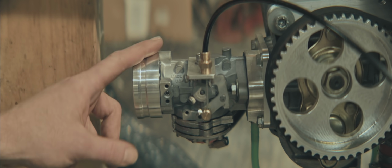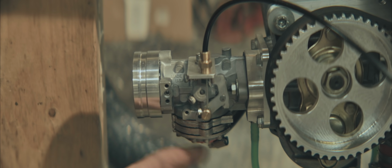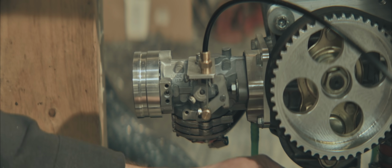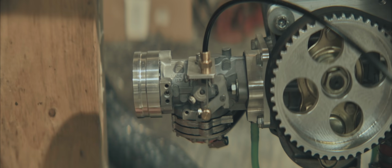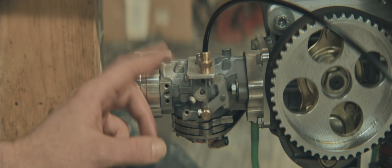Parameters to play with and stuff that might need to be fixed. Fueling. The carb might be running out of fuel under load. There might be some trouble with feeding pulses to the pump from the pressurized plenum. It might not be pumping enough. Should try to take a signal from the exhaust instead. That might work, if it's running out of fuel.